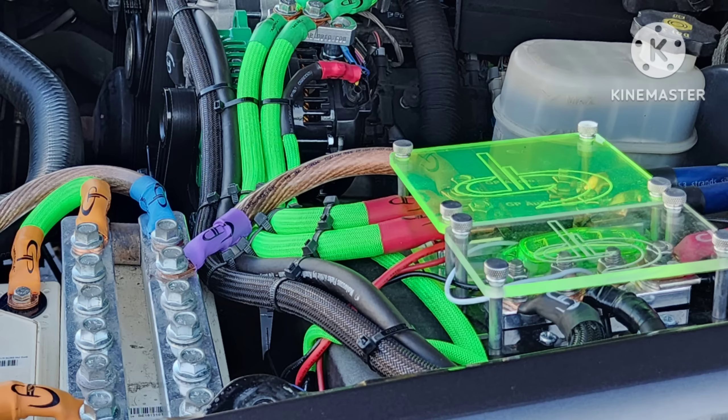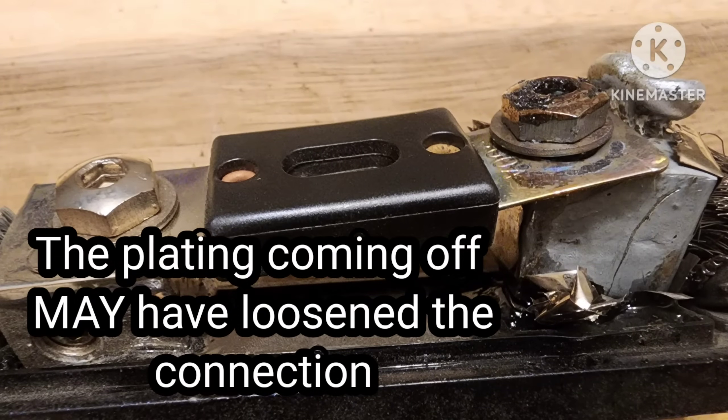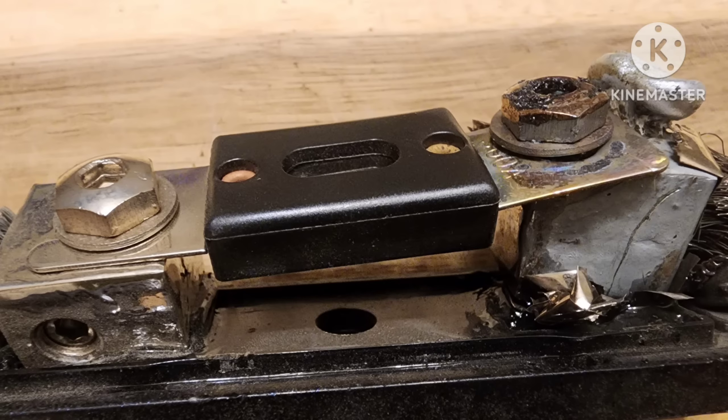To be perfectly honest, the best way to make sure this doesn't happen is to every month or two, pull your cover off and check your bolts on your fuses to make sure they're still tight. They get loose, and when they get a little loose, you get a bad connection. The bad connection creates heat, the heat swells and shrinks the metal making the connection looser, and the looser connection makes more heat — it snowballs.